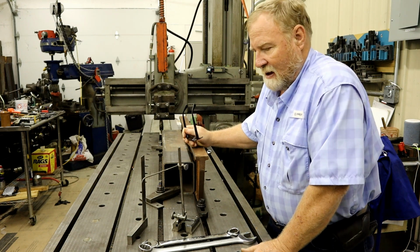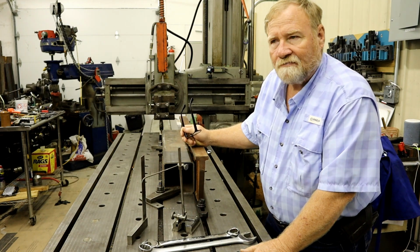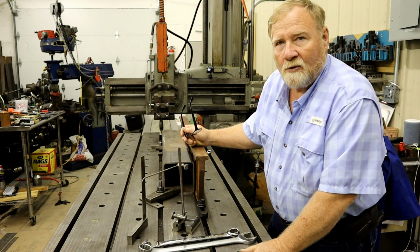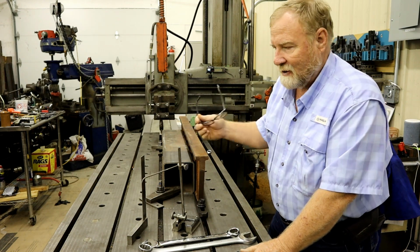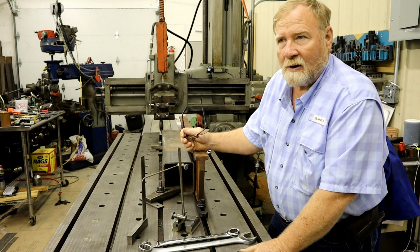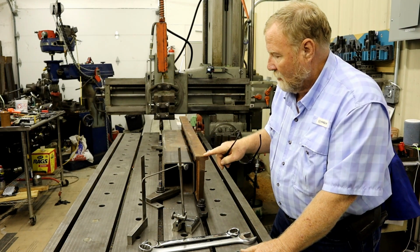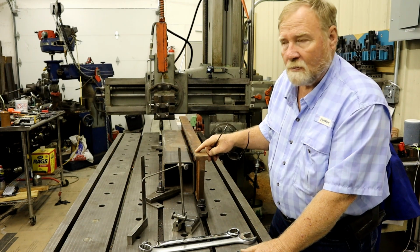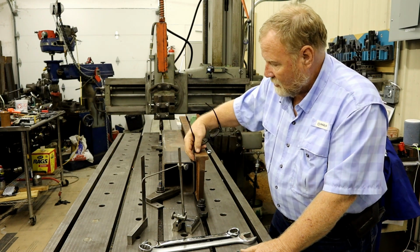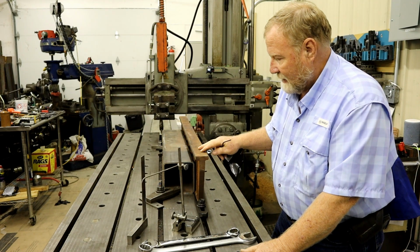Now, one time, Richard King had a person who was doing his castings, and some of them weren't very good. They were putting steel drywall screws into the mix, I guess, to improve it, but they weren't melting all the way before they poured them. So I ran into about three or four that had cavities under here. They look good over here on the face, but once I started cutting down into them, little pinholes started to peel. Shoot, there were some big cavities in them. This one's not going to be so much because this one isn't very thick, so I'm hoping it's in really good shape.